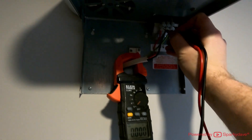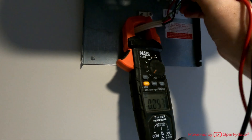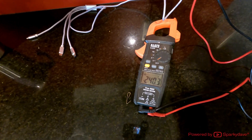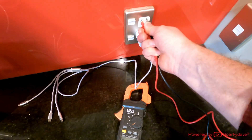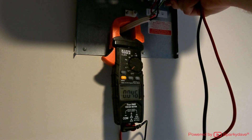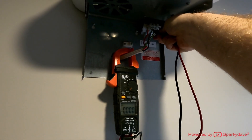Testing at the heater here, we can see the meter is displaying there is no voltage on the cable. We'll test between phase and earth, and phase and neutral, and then verify that once again the meter is able to determine 240 volts at a known live power outlet. We can be assured this cable is in fact dead and we have de-energised the correct circuit for the bathroom heater.